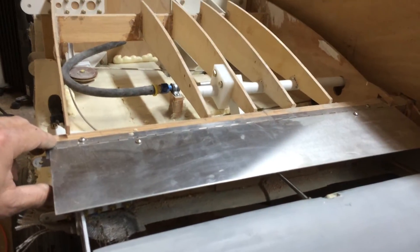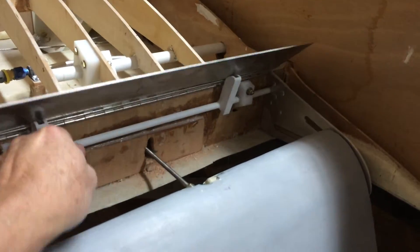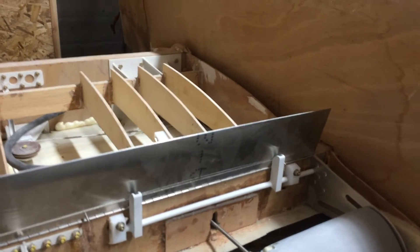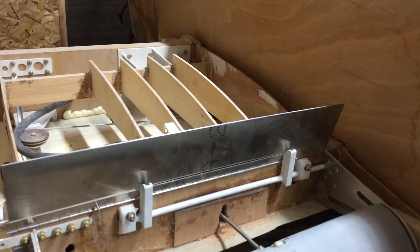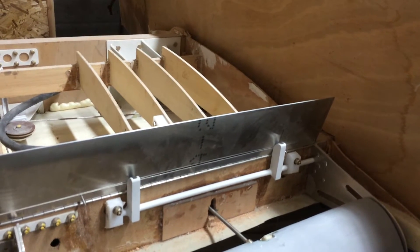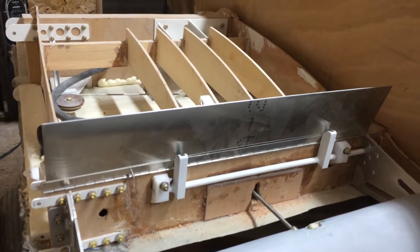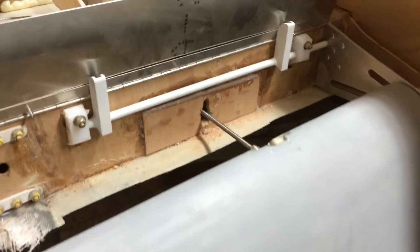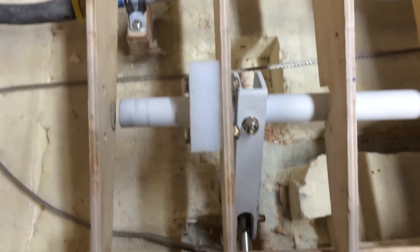I'll show you a little more underneath here. Inside the cockpit on the right-hand side is the actuator — basically it's just going to push the spoiler up, and that's the point of a spoiler: to destroy the lift. I would imagine we could probably get the spoiler up an inch or so and it will cause the air to separate, causing sufficient loss of lift on that wing. We have it capable of full travel so that if we need a little extra wind pressure for braking and to add downforce on the tires, it's there. We have the flap attached to a stainless steel threaded rod which goes through onto roller bearings into the flap mechanism.